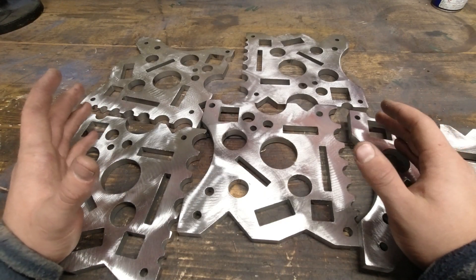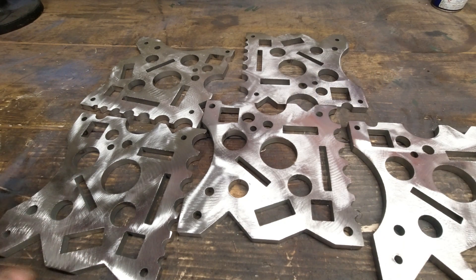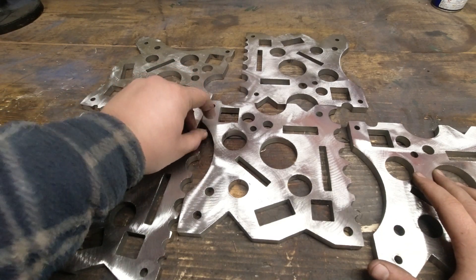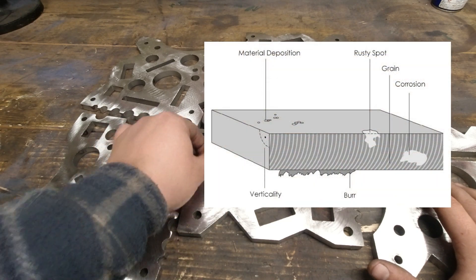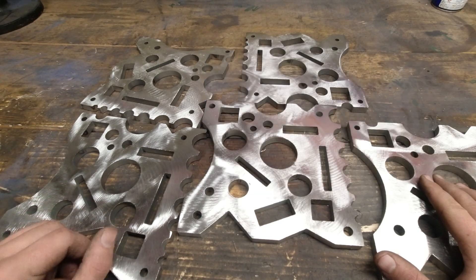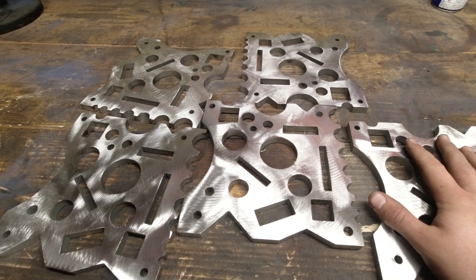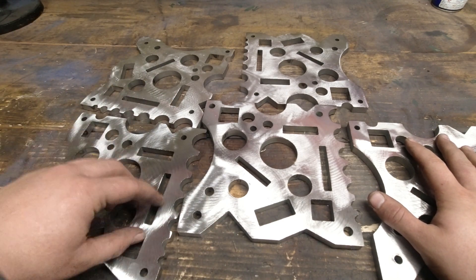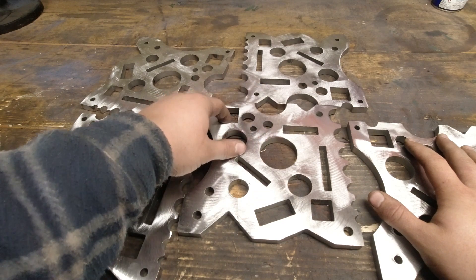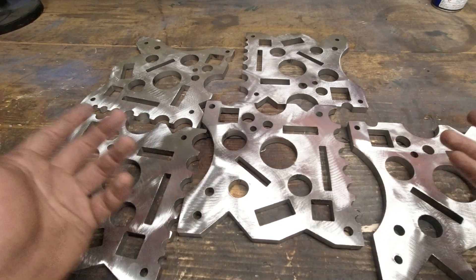I really need to invest in a grindmaster. If I had a spare 100 grand I'd probably be able to get one. We have deburred all of these — it took quite a lot of work. The fiber edge that you get on laser cut parts was really, really hard. What would be quite nice is to shot blast these individually or put them in a big rumbler, just to take off the burrs, because there is a bit of a burr on there. It's a using tool — it's not meant to be pretty.